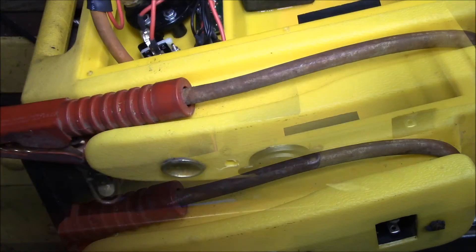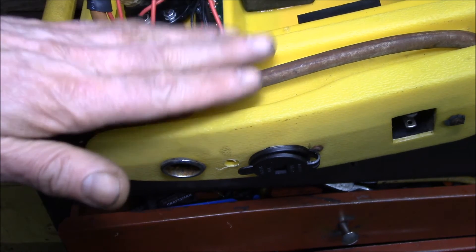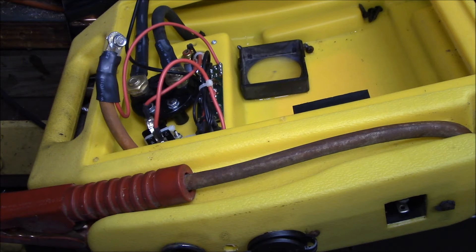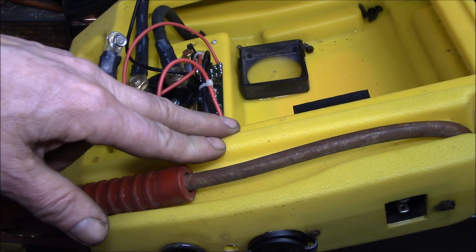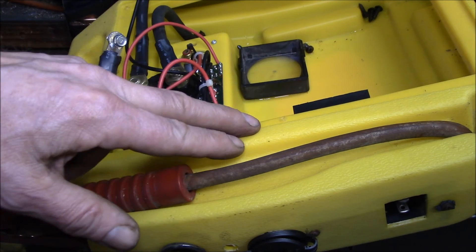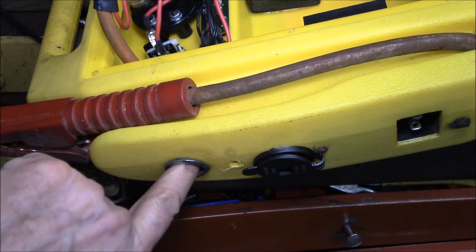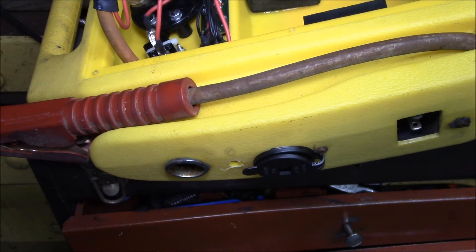The reason I want to rebuild this: number one, it's handy to use by itself, but I'm also looking at setting up a solar panel and charge controller in my shed. I've got an 8 by 10 foot garden shed that could really use some light inside and maybe some battery chargers. I was thinking this would be my solar battery bank. I've got a pair of 15 watt panels, so 30 watts of solar, and this will have a 26 amp hour battery. I can just plug a lighter plug in so I can easily disconnect and take it with me.